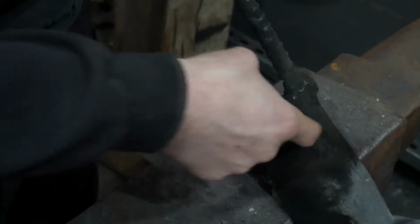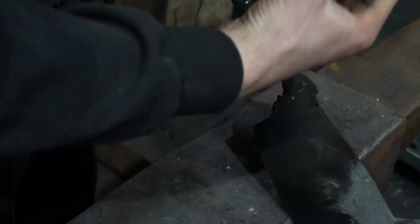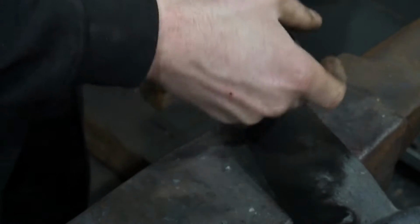The neck, you may have to do something similar at the snout when we put the nose in, because we're going to be curving this part round and then doming out the nose. So again, that will thin the steel there quite substantially.